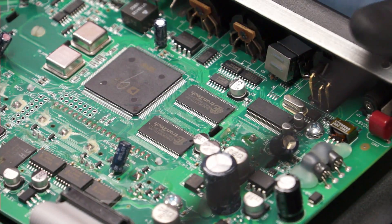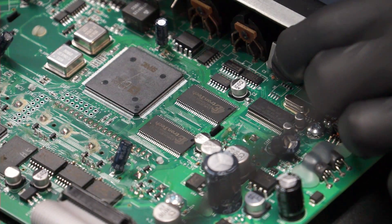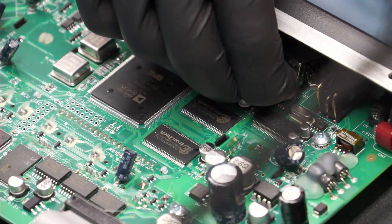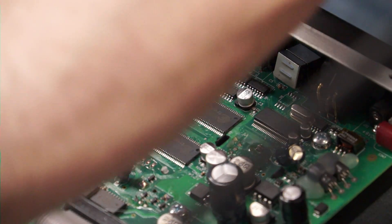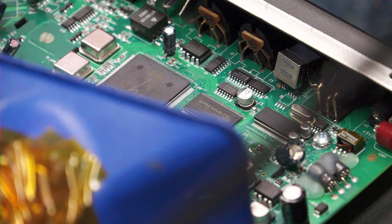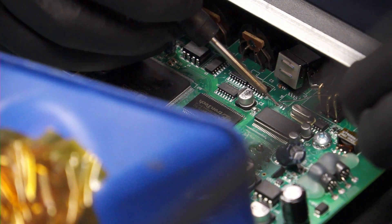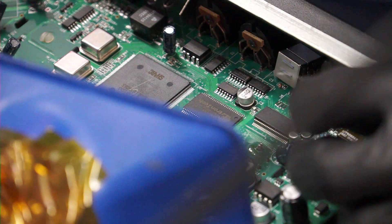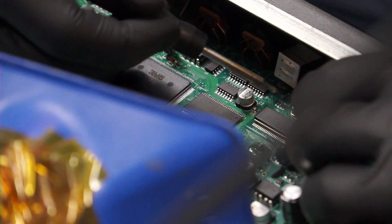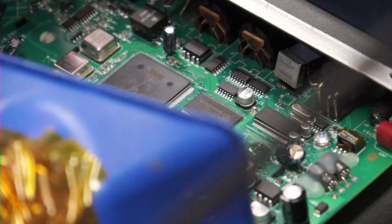This is probably the only job I'm gonna do today and it doesn't require a microscope. There's a couple of issues: first, there's a capacitor that looks like it was completely destroyed off, which I'm hoping isn't important because I'm not gonna replace it since this is charity. The USB port is really messed up, so it's keeping me from seeing what I'm doing. There's a hole in the corner which is gonna tell me which way the chip goes.